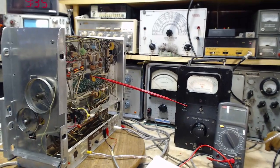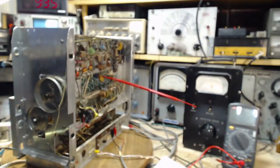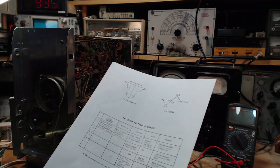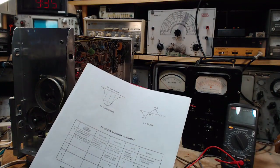Situation now is, let's see, what has happened here? Why would it be that meter no longer shows any output? Flipping the signal generator to 67 kilohertz, either it's disturbed the signal generator, or that change makes this reading unimportant. Is that why they have you set it? Of course, they imagine you've only got one VTVM, so you can't be measuring two things at once. If they're thinking that, then you set it in the first step and then leave it and don't worry about it. Now, I've monkeyed with it, so it's all messed up. Everything's messed up again.